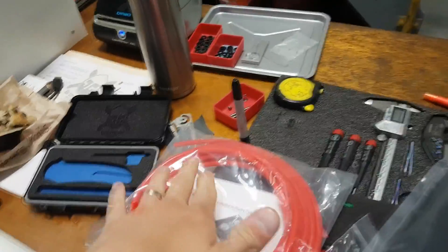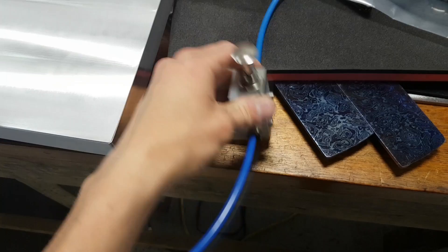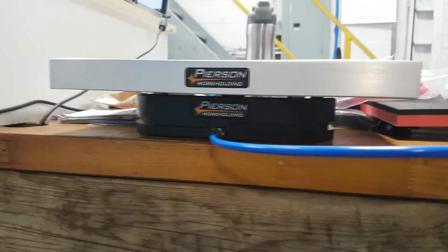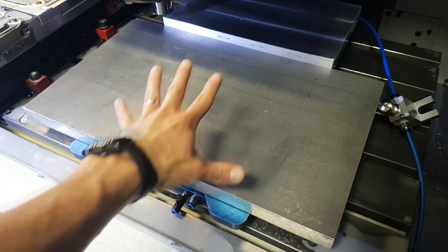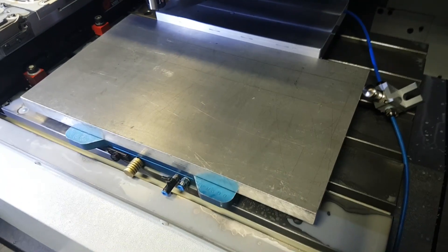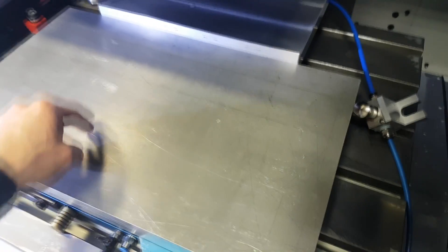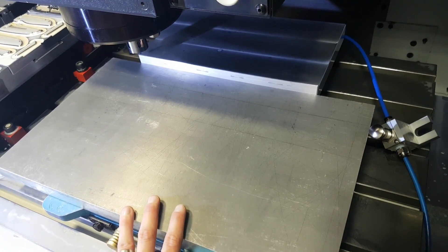All the little fittings, comes with hose, comes with super good instructions, everything is packaged nicely, comes with even a super simple mounting bracket so you can mount this right beside the pallet. I love the two logos — it's awesome. So I've got the vac magic with this gigantic fixture plate here, so you can use the vac as a vacuum — which the grid pattern is for — or a fixture plate. I might use this gigantic piece because I've got two of these big fixtures that have been sitting here for two years unused. I can either suction it down or I can put four bolt holes into the threaded spots and then I'm not eating up air — it's bolted down. So I might use that for making some of our spinners or other products.